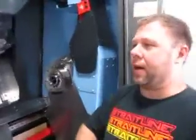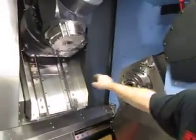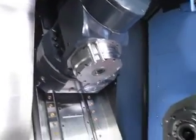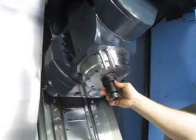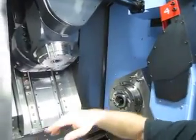The MX is a mill-turn machine — it's got 5-axis milling capability on two spindles. We've got our main spindle here and our sub-spindle here. We've got our turning turret down here, which is X and Z. Then up here we've got a milling spindle, which can also be used for turning. Our tooling goes in here — that's a milling tool with a collet chuck. This is free to rotate this way and that way, so we can work on the front or back spindle at the same time.